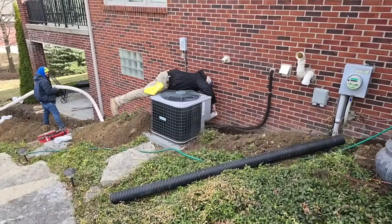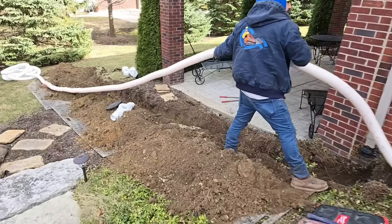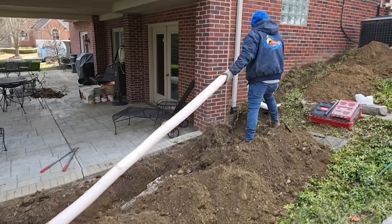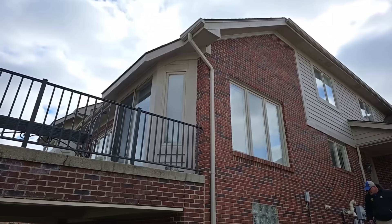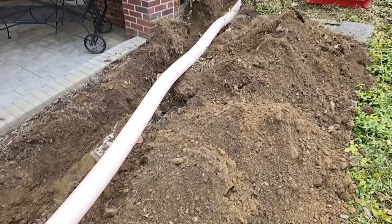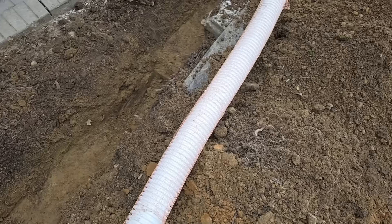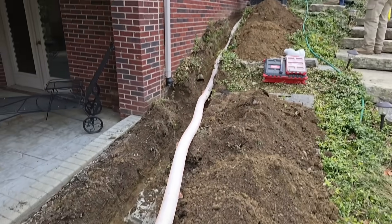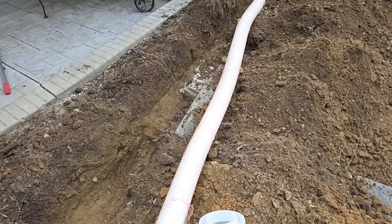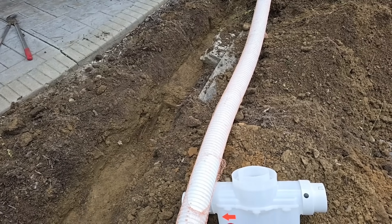The guys are working together to set this line — it's a really long run. This whole line is going to be on three-inch plus. One downspout is moving a lot of water; the other not so much. That downspout right there has only two feet of gutter on it, so it's not going to bring that much water. We're going to merge them together right there and use one of our sediment traps. Once we get past the second one, we'll put the sediment trap right here — because when you go from a really steep grade and then it suddenly flattens out, the water decelerates and drops all the sediment. This is a great spot Valente picked for the sediment trap; it's going to grab all the shingle gravel coming down this downspout line.